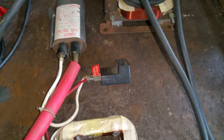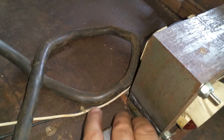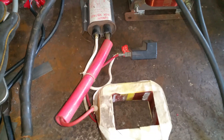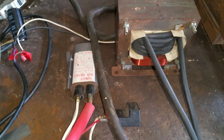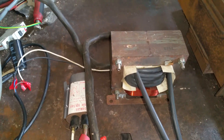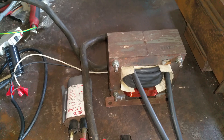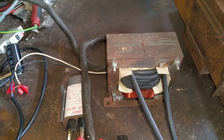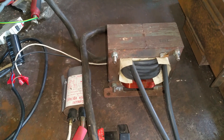I basically cut the bottom of the transformer — there used to be a weld there — cut that off on each side, the two halves separate, and you can pull the coils out with a bit of effort, then re-weld it up later. I originally started using 70mm cable for my secondary, got about three wraps in it, and it ended up being about 3.05 volts, which isn't bad. I don't know what the amperage was because my multimeter only goes up to 200 amps, and it was well above that.